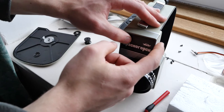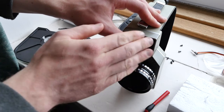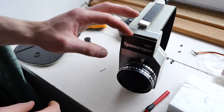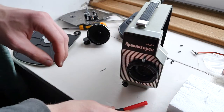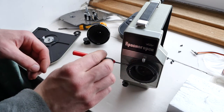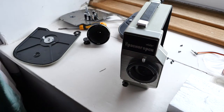To remove the front of the camera you need to get this metal plate off. In my case I just got a craft knife underneath it — a very sharp knife — and it just came off really easily. Then you need to make sure there's no lens in the way, and loosen the screws — there are three screws on the outside of this lens mount that you need to take out.